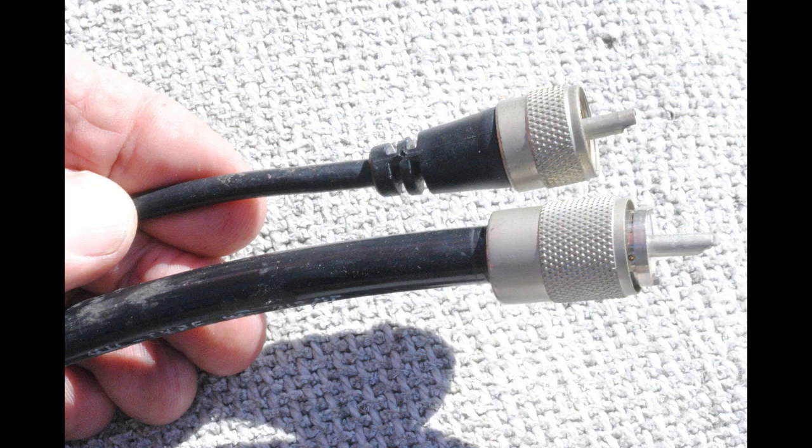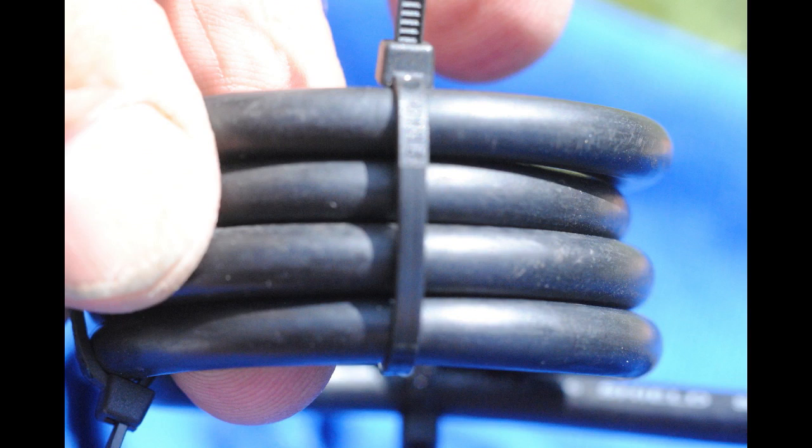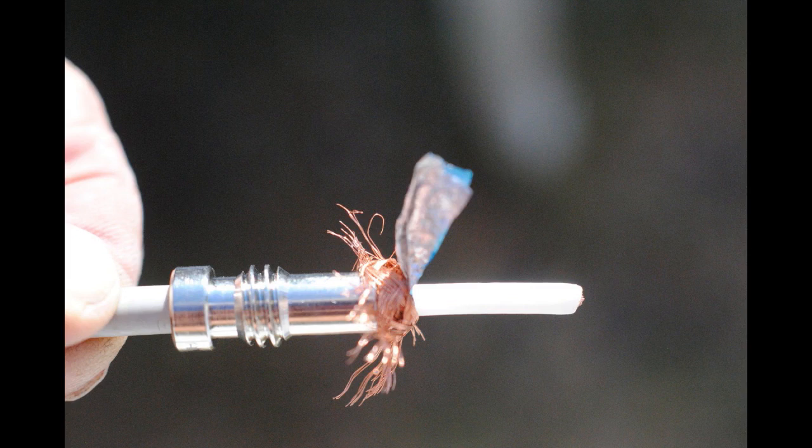Do whatever you can to get them spaced away. If you're running 10 feet or less, certainly use the RG-8X you see on top. But for those who really want to do it right, use the great DX Engineering line of coax cables — LMR400 type. With all that braid, you're ready to go. But you wouldn't use big coax for a small little balun that helps mitigate signal coming back down the braid — small coax does have its place.